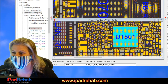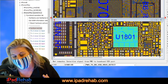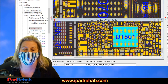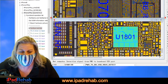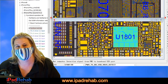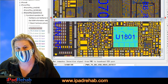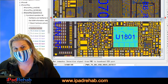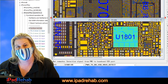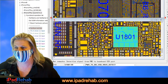All right, so nevertheless, I think this is too boring for stream. I will update this with a comment to let you know, if you sit here and watch it long enough, what the problem was. By the way, the last one I meant to update, where we did an experiment with that botched TriStar and booted the phone with no ball under the TriStar UART RX ball, it didn't talk to the computer. When I replaced that, I put a jumper on that line, and it did talk to the computer. So there's the mystery solved on that one, and I'll update that one with a comment as well.